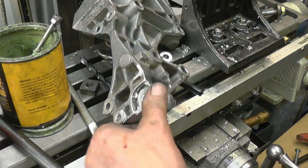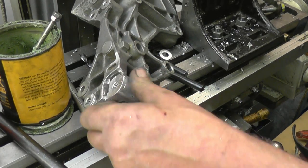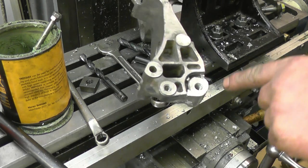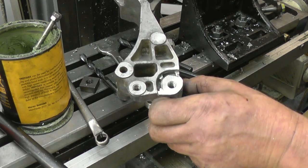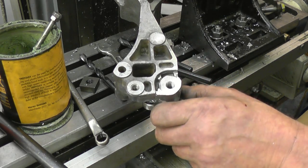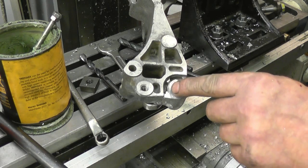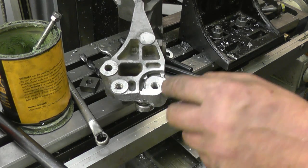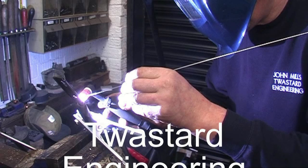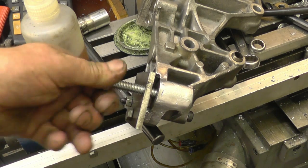That's the finished repair, cleaned up. You can see the metal is nice and solid with no blow holes in it. Quite a reasonable repair — I guarantee it won't come off. I've actually put a bit more metal in, built it up a little, made it a bit stronger. There are no clearance issues on this part, so I've just reinforced it a little bit. There's actually a witness mark showing the original depth — we're just touching that, so it's in the right place at the right depth. I'm sure the customer will be happy with that.